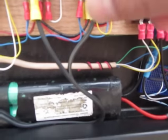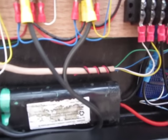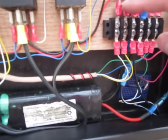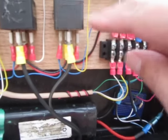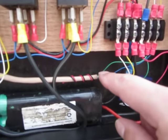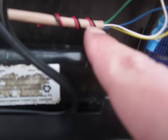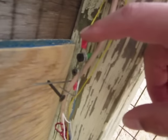These two circuits from relays, white and yellow, relay white, relay yellow, or as I named them in my wiring diagram, A and B, or B and C, go out to the white wire, which is right here, white wires on the bottom, and the yellow wire goes out through this cable, which I'm not using the red and black, you can see that. The yellow wire goes out, and that's the one on top. That goes to this right here. So that's the feed. The return is the blue and the green.